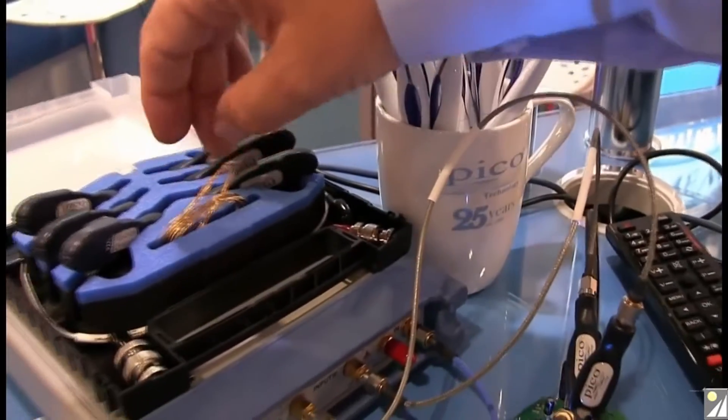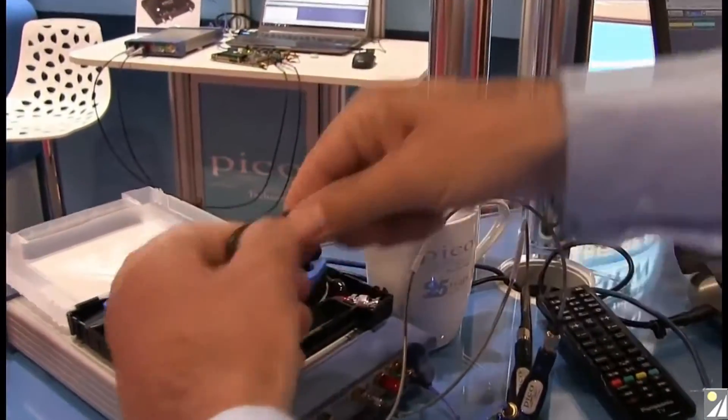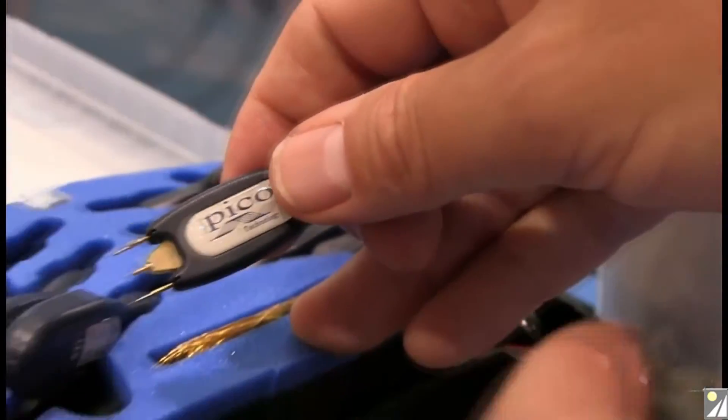Here I've got gold-plated wire that you can use to solder the probes in. The probes, incidentally, have a removable set of pins — with a pair of pliers we can pull those out and replace them with direct connections for solder-in if we wish to.